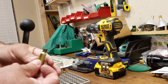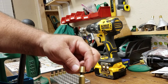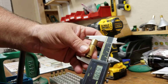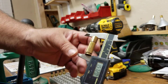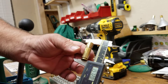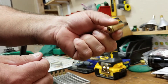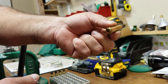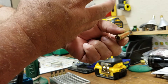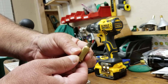I'm going to wipe the lube off the brass, then put the shoulder bump gauge back on and re-measure it. Now it measures one point five seven two. So that means I've bumped the shoulder back two thousandths, which means it should slide into the gun and stop just short of the chamber wall. That way, when I fire it again, it'll expand and I'm not working the brass too hard — I'm only sizing it down two thousandths.